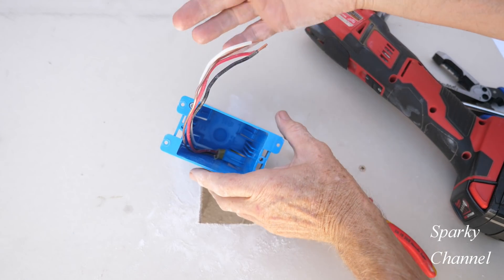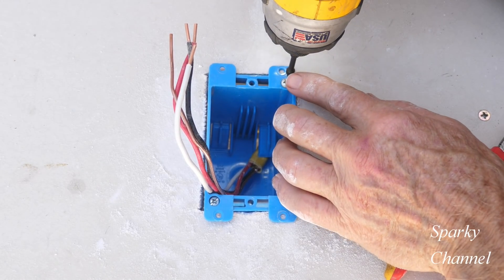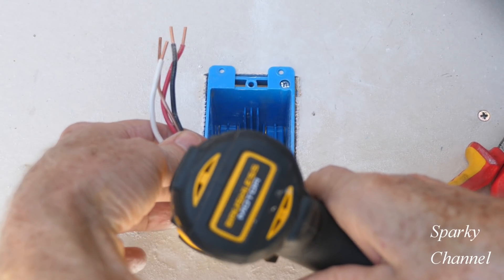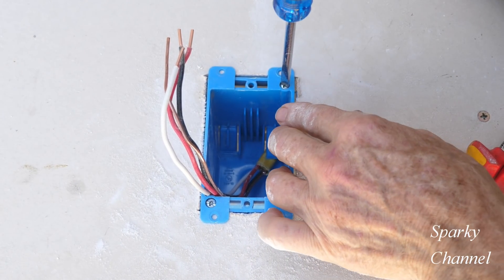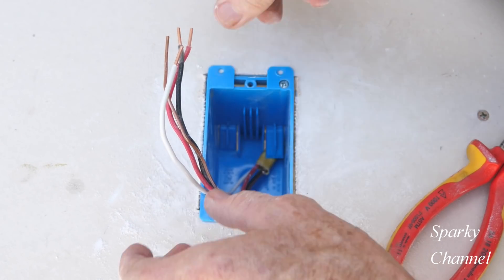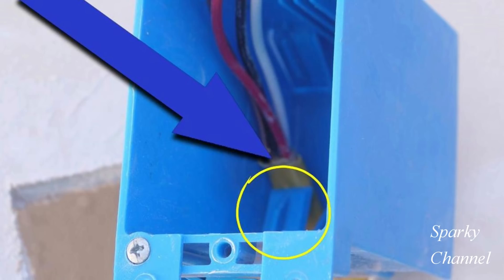Just work it in here. We've got our wire out about eight inches from the end of the sheathing — put it just like this — and we're going to tighten down these screws, finish it off with a hand screwdriver. Now the box is very secure, we got a nice neat job there, and we're ready to wire our three-way switch. Notice that I've left about three-eighths of an inch of the yellow sheathing in the box, and the little blue flap is still operating as a cable clamp.